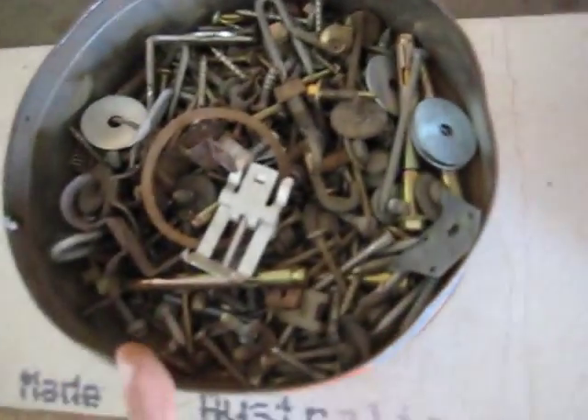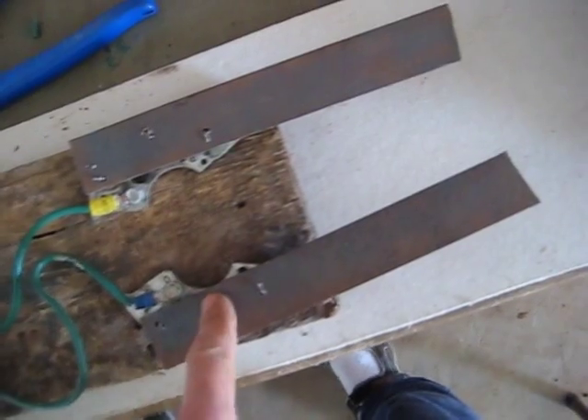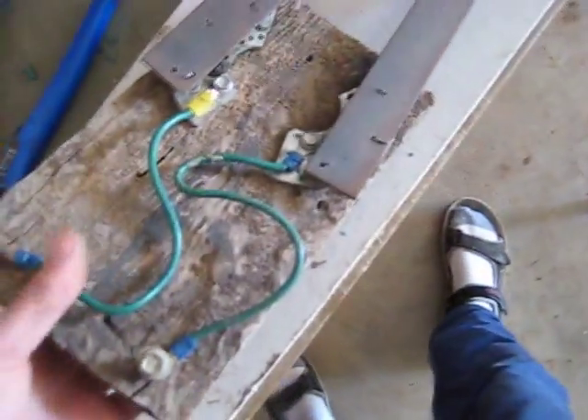OK, there was half a dig around for some tech screws and bits and pieces to put this together with, combinations and stuff. This is what I came up with. Big heavy wood tech screws. Some galvanized steel bushes. Clamp one there, clamp in there from the welder — comes out through here, my outputs. Got to find a better way of connecting these up though. That's just how I'm doing it at the moment. So that will work. I'll put a multimeter on there and see which one's positive or negative. Even a bit of spray paint — I'll just use texta for now, but later on I'll get some spray paint and do it all properly if I get time. But yeah, that's sort of what the rectifier thing is going to look like — a little portable thing. Put in any AC outlet transformer.